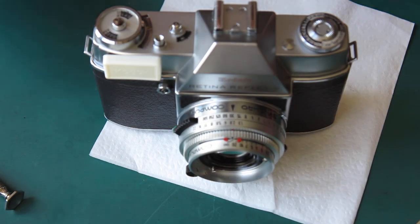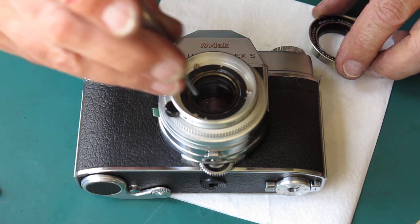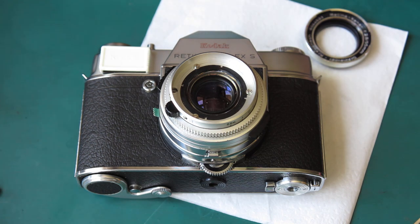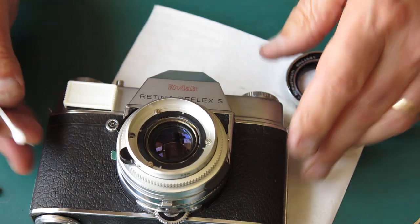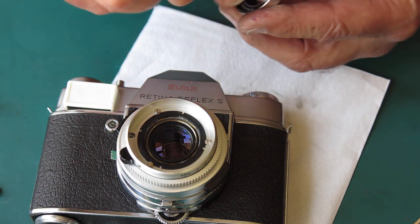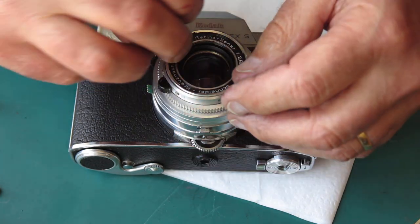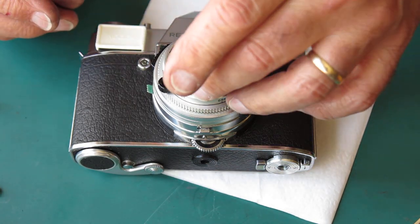And that appears to be the case — so that's good, that part's done. Checking my three screws — you don't need to go mad doing them up, they just need to be nipped up. With some lenses if you go crazy doing up screws, you end up distorting something and then instead of the action moving smoothly as it should, it goes all hard and bumpy.